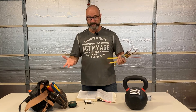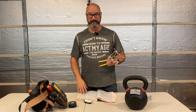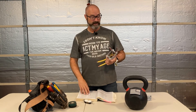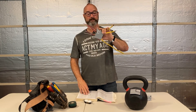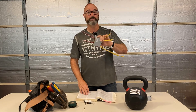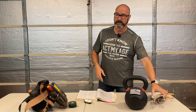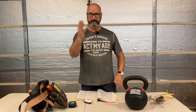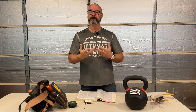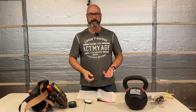One of the ways to fix this is to become familiar with how many cubic inches your boxes are and what they actually have. If you're a little lazy like I am sometimes, when you buy boxes just get the biggest boxes you can get in terms of cubic inches. 18 cubic inches isn't the smallest box, but you can get them in 20 or 22 cubic inches. Why would you spend an extra 40 cents? I don't know — why wouldn't you? Spend 40 cents; you can put the wires in there. You still need to do the calculations, but if you're not crowded it's just a better install.